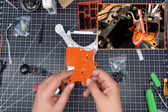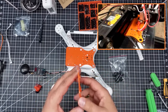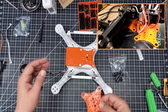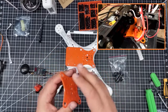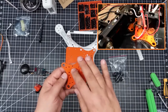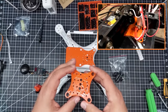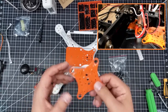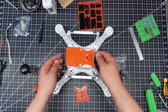One of the things I'm always a little bit apprehensive about is using 3D printed components in copters, especially where they're going to bear some weight, and a lot of it is due to vibration. One of the pieces — you probably noticed it's a bit shiny — what I do is after I print this out, I paint it with epoxy, typically five-minute epoxy, and then it tightens right up. It makes the part far more solid and less likely to come apart due to vibration.